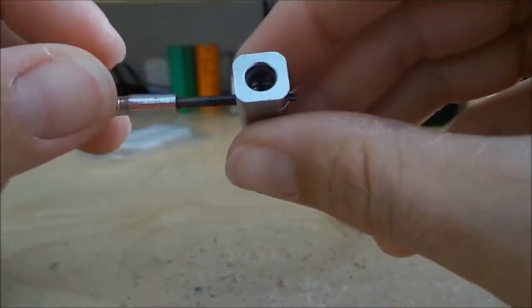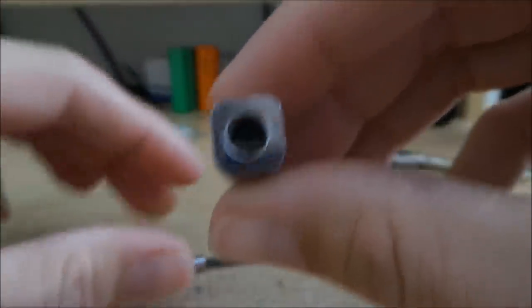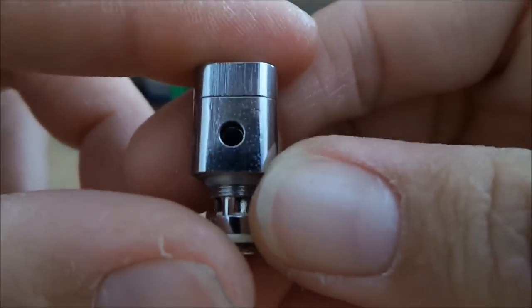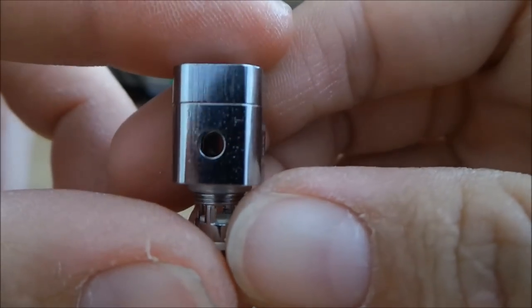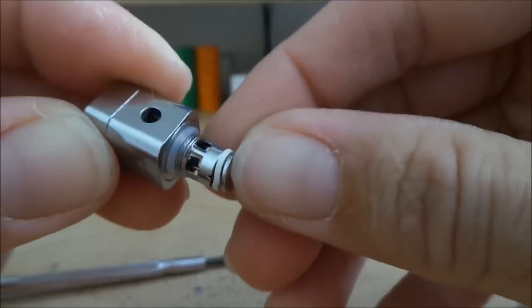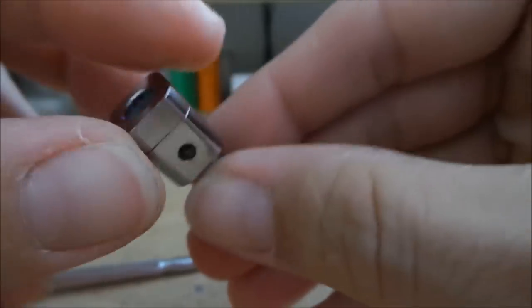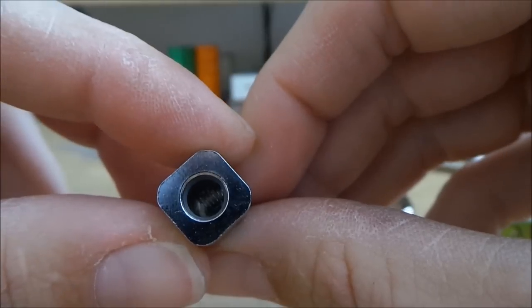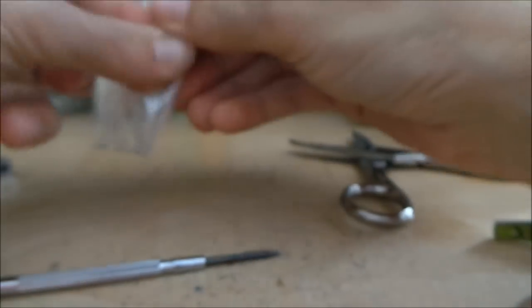This part is very important — I had a lot of issues with this. You have to clip these wires pretty much as close as possible because if they're sticking out even a hair, you're going to have an issue. That's what the nail clippers are for. Snip them as close as you can — there's one lead and then the same on the other side. All leads are snipped close and the coil is still in there. Now carefully remove the bit and you can still see the coil, perfectly aligned with the holes.